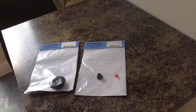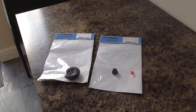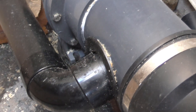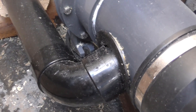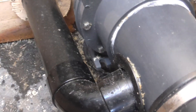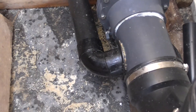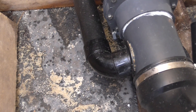Let's go and have a look at the 2-inch one. I've put the 2-inch uniseal into a 4-inch pipe so you can see how that works. There you go - that's the 2-inch uniseal going into a 4-inch pipe, and it works great. It seals it up perfectly. So if you're thinking about putting a pipe into another pipe, or any rounded surface - could be a drum, one of those big containers - if it's round and you can't get a bulkhead to seal on it, uniseal is what you need. They'll do the job for you.